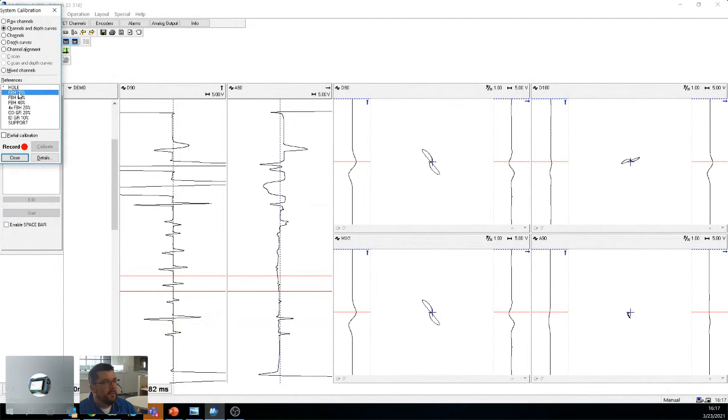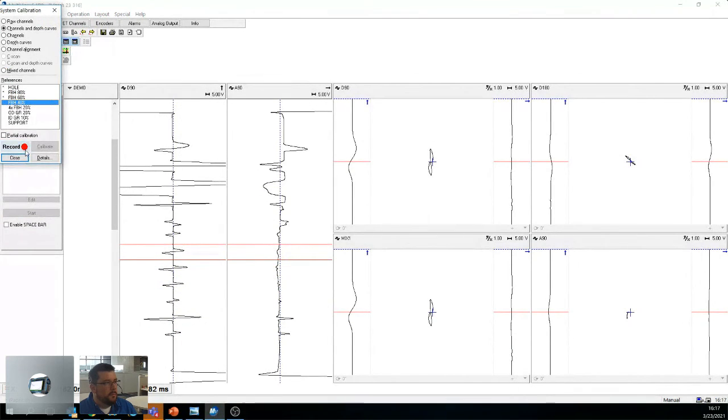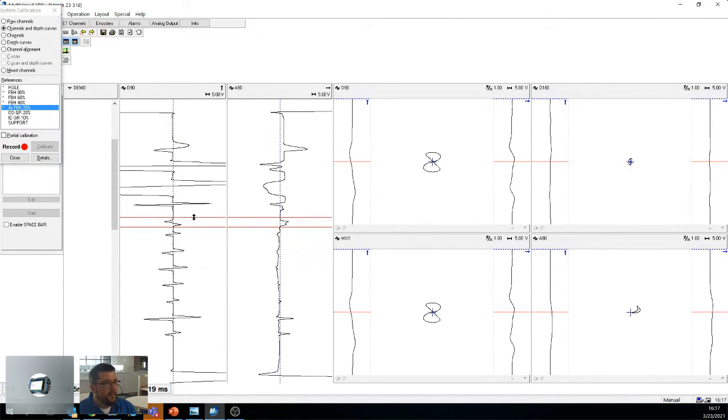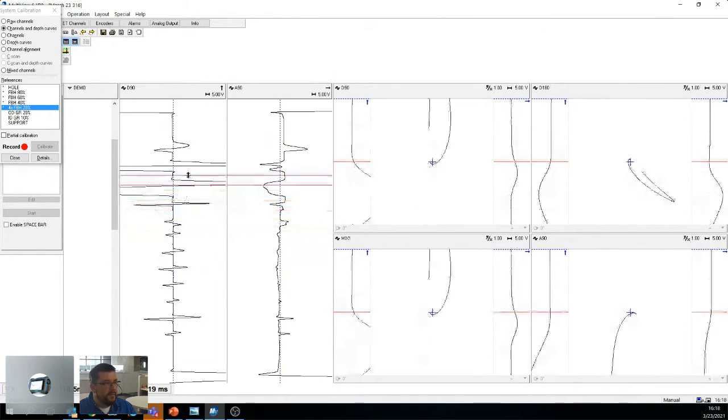So what I'm doing now is I'm just telling the software what I physically did. So I'm just saying, well, these are all my points. I'm going through my cal tube, putting them down. This is the 4 times 20 right here. Interesting fact, because you can see the support signal is the opposite. All my defects go from left to right, left to right, left to right, left to right, and then this one goes right to left. So support signals, because they tend to be carbon steel, have the opposite form than eddy current or defects.